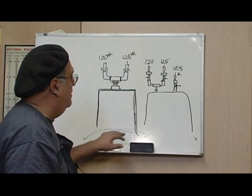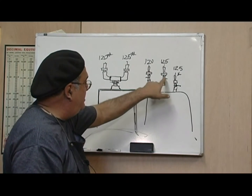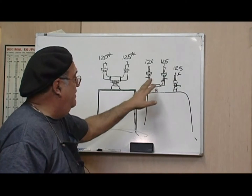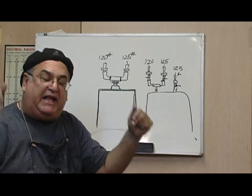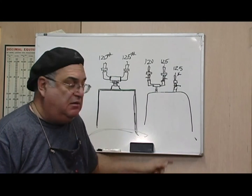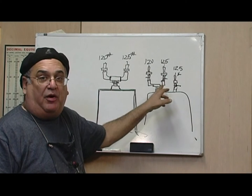Okay, this is the test. I'm going to shut this valve, so now we're on these two. I'm going to see if it works. Works, don't work, whatever — I'm going to do it. Then I'm going to shut this valve, the 125 here, and only use these two, and show that it will pop. This one will pop and that one will pop — I know it will, because I've done it many times. But I'm saying it's not going to work on a T. Now it may very well work — that's the idea of this test. It's nothing to do with theory. I cannot stress that enough. Forget the theory. I want to know about reality. That's the way I'm going to test it. I'm going to test it with quarter-inch pipe, and I'm going to make one up with eighth-inch pipe, and we're going to see how it works. These are going to be quarter-inch ball valves, because I want the flow to come freely through.